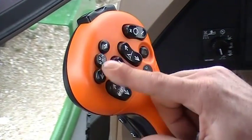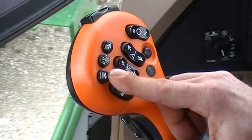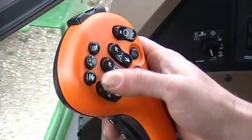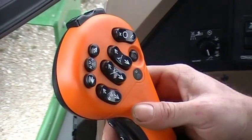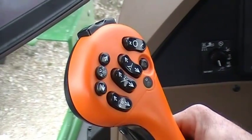The button above this will sequentially shut off boom sections as you go through the field. If you do not have swath control, this is one way — when you come up to the end, if you hit this button it will actually start shutting off the sections from the right side to the left. The center button will turn all those sections back on.